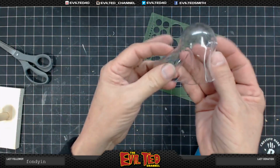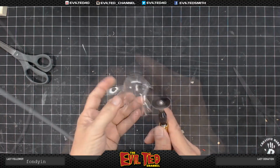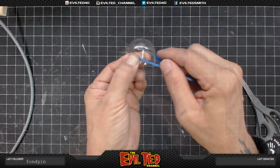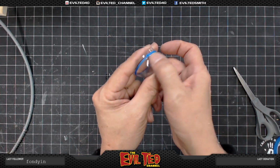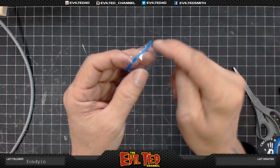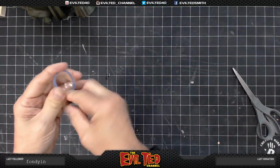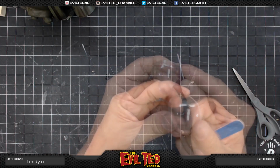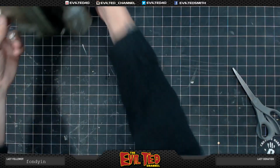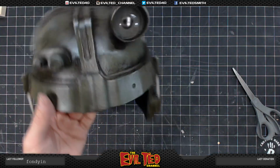That's it. Yeah, the best bet to do is go ahead and cut off the bottom. What I want to do is, I think it's best, I get some tape, and we'll just tape out this line. Tape's going to be my guideline. So I'm going to take the tape, take the cutting wheel, and just follow the inside of the tape line. Yeah, looks good. I'm going to go ahead and get a sanding stick. It might be a little uneven on the edges, but it doesn't really bother me because that's going to be hidden once you put it inside the, you see the little shroud there. See? Look at that. That's perfect.